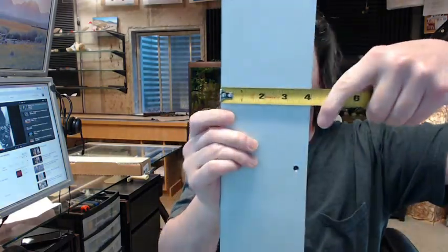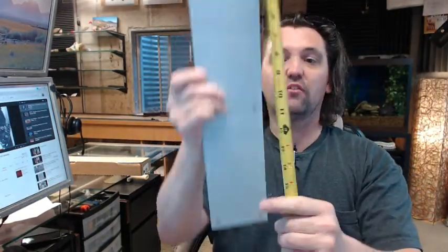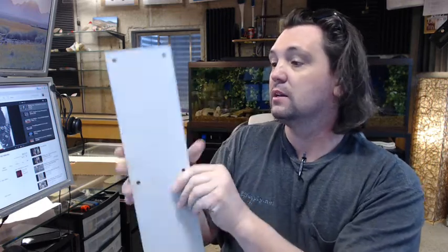Thicker versions of this are available. 4x16 is the most common size used in general build-out construction — by far it is the most common that we sell. I personally happen to like a 6 inch wide plate versus a 4 inch. If you notice, bathroom doors have got a wear mark because the plate is, in my opinion, just not wide enough to cover it up. 6 is better; I like 8 as well, but 4 inch is the most common size.